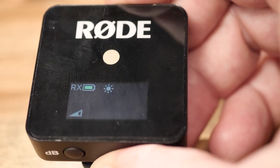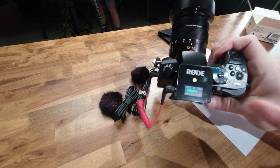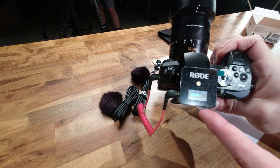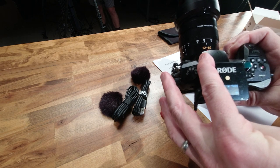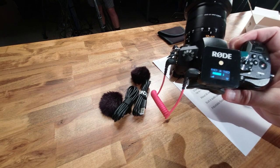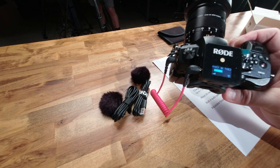There are lots of little data points on the display. When you turn it on, you can actually see your battery level, see if you're connected, and what your transmission level is. You can see the volume level bouncing on the VU meter. Both batteries are pretty low since they haven't been charged yet. The transmission and connection look really good. You also have a dB level — you can adjust the actual input from minus 12 to minus 6 to 0. Zero is your highest setting with no padding, which you adjust to avoid clipping or getting too hot of audio. It gives you basically high, medium, and low settings for your audio, which is great because sometimes cameras don't have a manual audio setting.